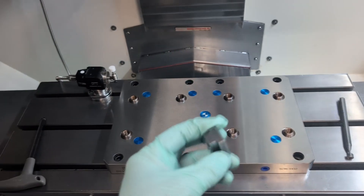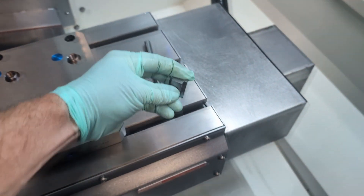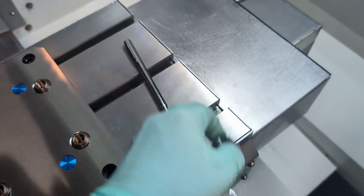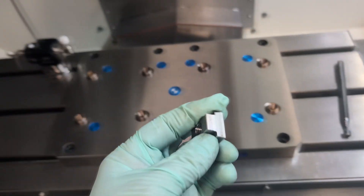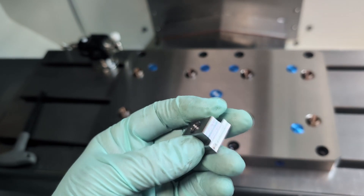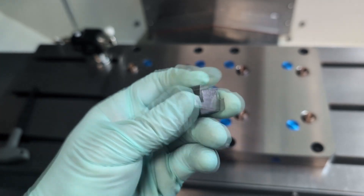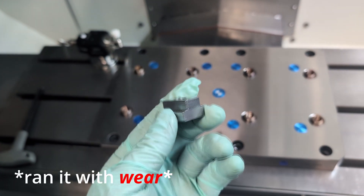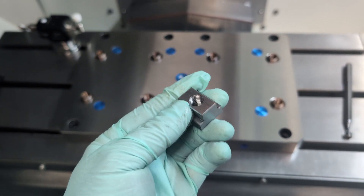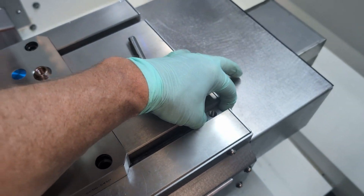I went ahead and fabbed up — this is one of ten T-nuts that I made that work well with my table. This is a 14 millimeter T-slot. The critical dimension here — I modeled this off of other T-slots that I really like that I got with my M-LOK device — but this dimension here is 13.9 millimeters. I ran it in control when I machined it, and this 13.9 is a little plus actually.